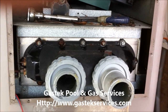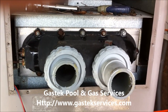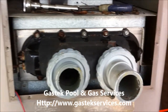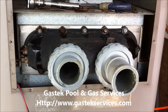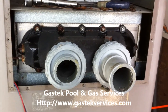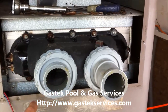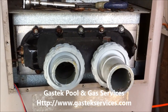People often wonder where the flow diverter bypass is on a heater. On this particular model, back behind here, there is a plastic plate that on the original manufacturer was not very thick. Over a period of time it will break because it's just plastic, causing your heater to make loud banging and knocking sounds when it's trying to heat. What happens is the water isn't able to flow into the unit properly, diverting too much water out of the heater, causing steam to develop within the heat exchanger — which sounds like gravel inside, or knocks and bangs.